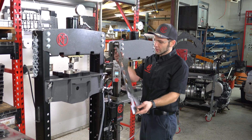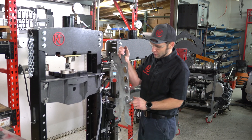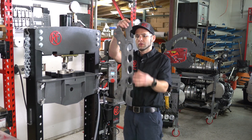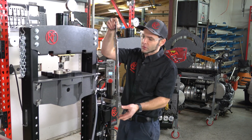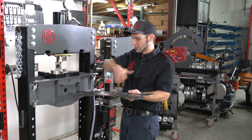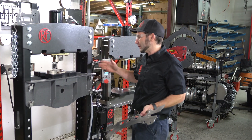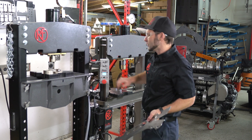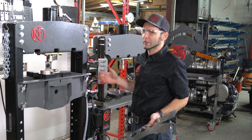So there I have a nice dimpled part. Once you set it up for the correct plate thickness, you're going to get very similar flattening and a very similar contact profile from the dimple die. You can get your parts dimpled even with thin parts that have almost no support next to slots used for bending, and it still comes out relatively flat. You don't end up with that crazy surfboard or ski shape to your parts. You can measure the force requirement and control it all with the same system. There's an analog readout on the glycerin-filled gauge, and also a digital readout right on the force control screen if you get the upgraded control.